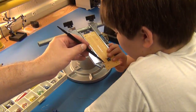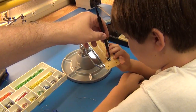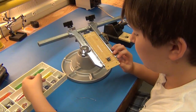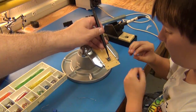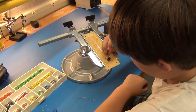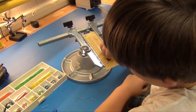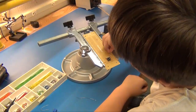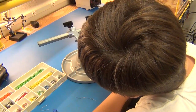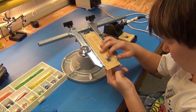So that one has to come to the same spot this one did. Take a wire up from here, up to one of these, and then come all the way across to here. You put it on pin 8, which is this one — right beside it, but in a hole. That was good, there's nothing wrong with that. Just bend it so it goes to the next hole down. Hold it down tight while you bend the little knobs on the back.